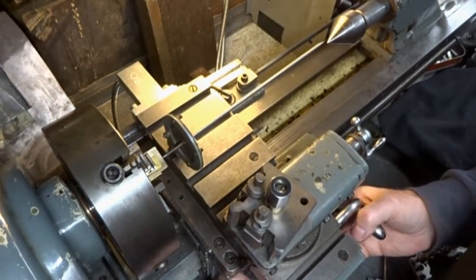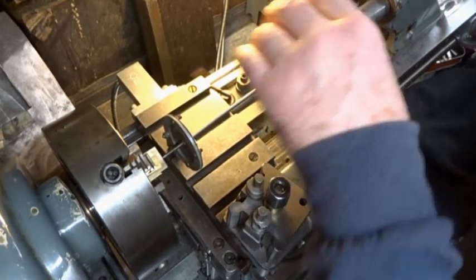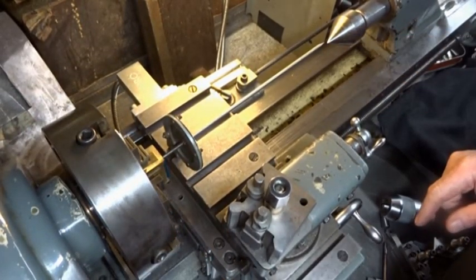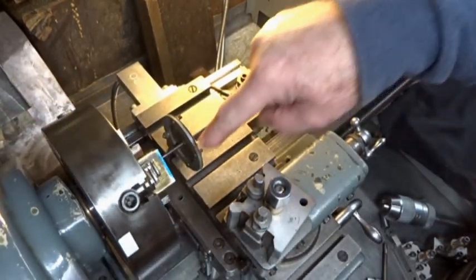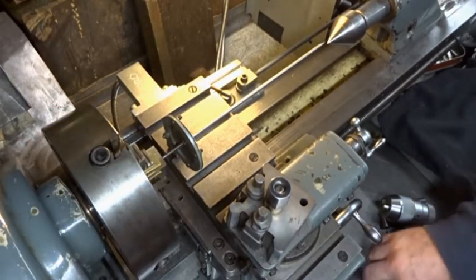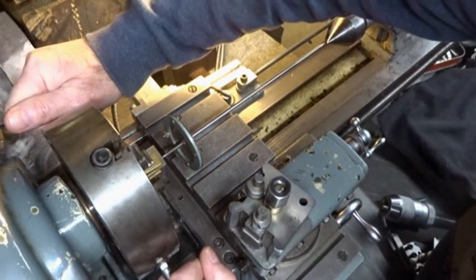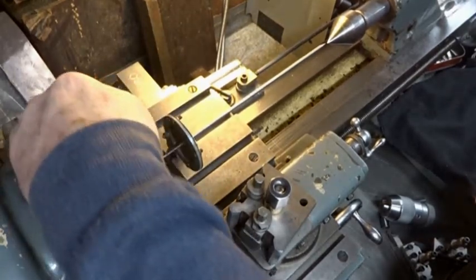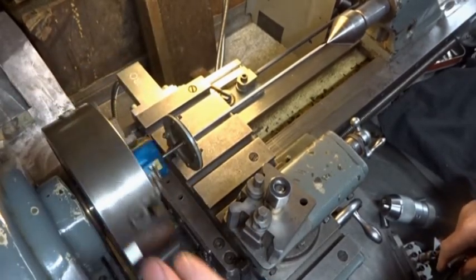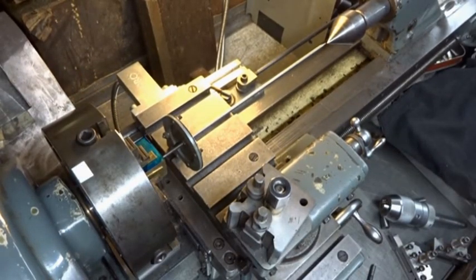And there we are — we haven't gone very far. Engage the carriage and bring it forward to keep the pressure on the pointer. Already you can see that's perhaps very close, which means this dot — because there's an 8 to 1 magnification — is already running pretty true, but obviously we can get it a lot better than that. Now that pointer is really barely moving at all, and as this isn't a totally precise part I think I'm going to call it at that.